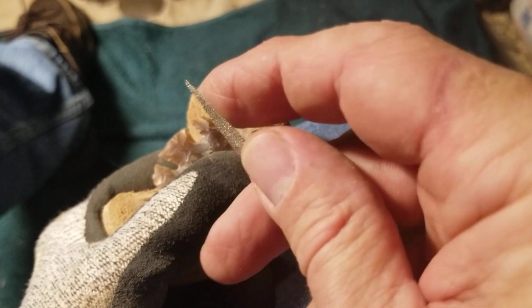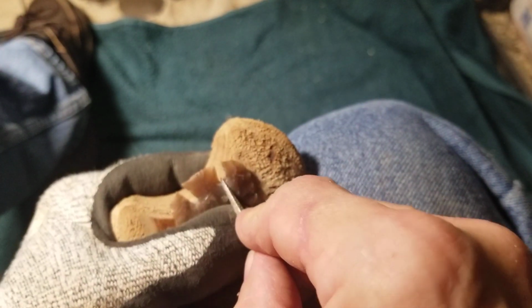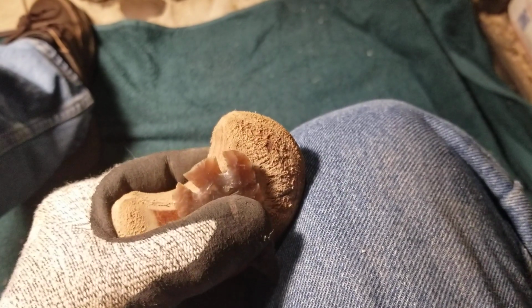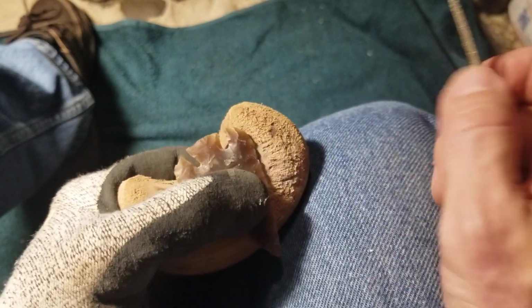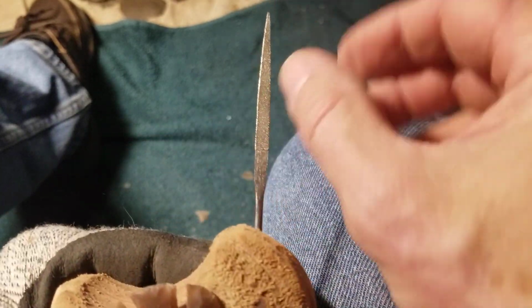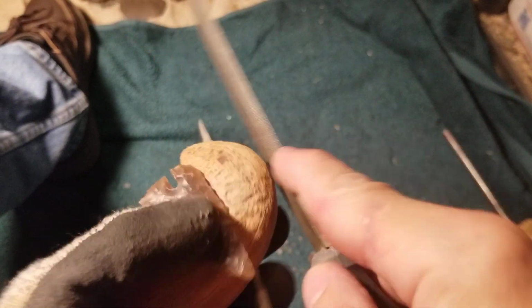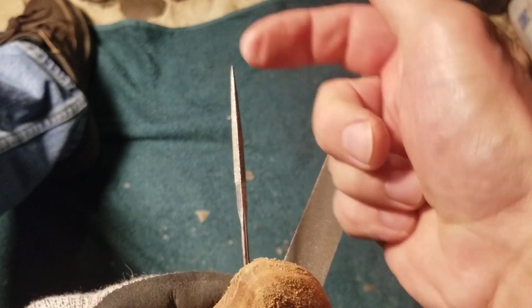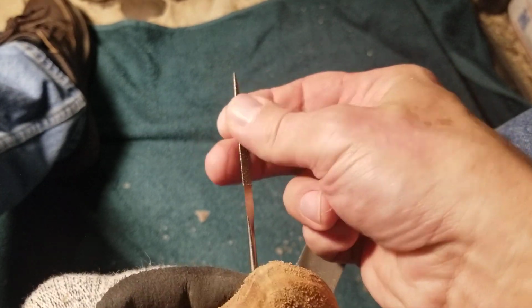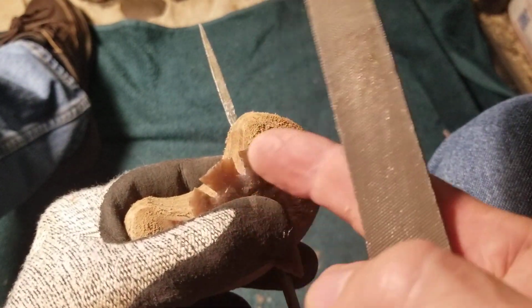You can use either a round or this tri-face type arrangement, and sit there and just file it down. You can also use a square, I suppose, and get in there, a narrow, let's see, spatula looking file, because they do have those too. They have the small version of the large file. They got a really tiny version of this, where the edge is square. Instead of having it pointy like this, this is a faceted file where it's got three sides. They got these as well, and you can use this at the bottom of the notch too and make it square automatically.